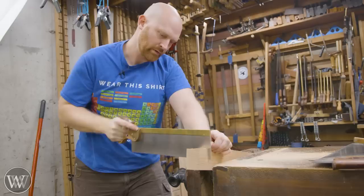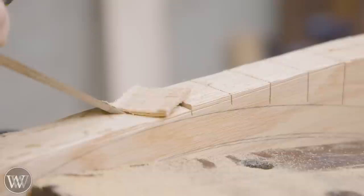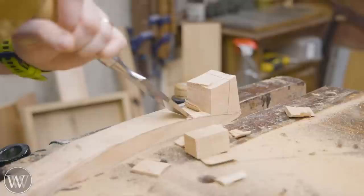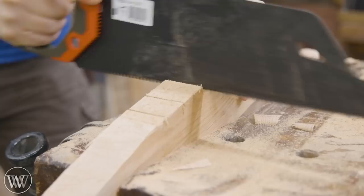I did a video recently showing how I generally cut arches, and I do it in the fun way. There's a bit of waste in here that I'm lopping off, but I'm not going to make much out of those anyway. So I'm going to cut down with a relief cut and then come into the chisel, bevel down, and run with the grain staying just off that pencil mark. I love these points when you can just hit it and the pieces just explode away. It is so much fun.